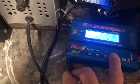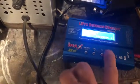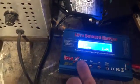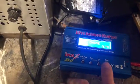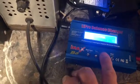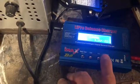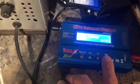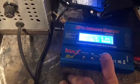I can adjust it up and down, so that's 3.6 volts — you can see it's set at 3.6. It's on automatic at two amps. I can do a 3.6V one-cell (1S) charge on it. The only problem is when it comes back it says the voltage is too low for it to recognize, so I go down and do an automatic mode and it will actually take the charge — just hold down the button.